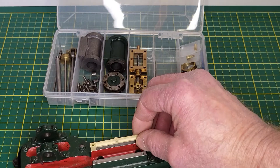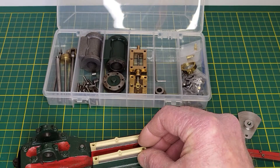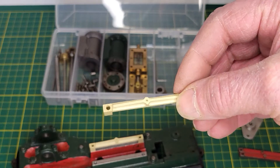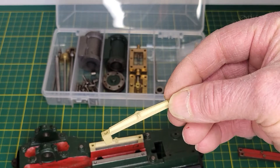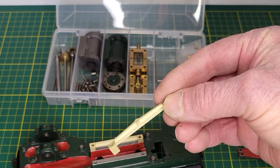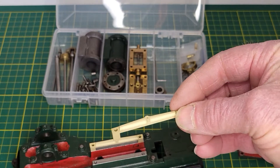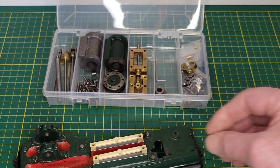I've already gone ahead and made my new replacement guide bars. Made them out of brass, as you can see. I decided that I was going to incorporate the standoffs into the guide bars themselves, and also give it a little bit of shaping to the top here to make it look more like a casting. After I made these, I went out and sandblasted them to give them kind of a cast finish. These are nice — I like them a lot. They fit perfectly and they look good on here.